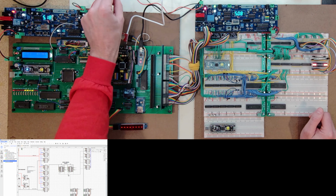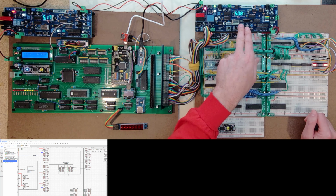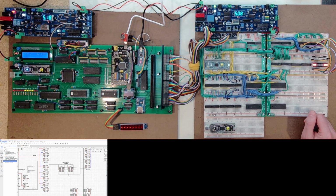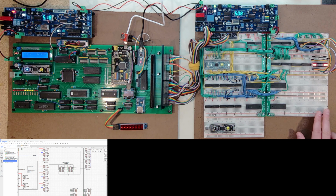I'm then running a small jumper over to this other card, and you can see by the time it gets to the middle of this card, I'm at 5.08 or 9, somewhere pretty close in there. And if I come down and measure down here, which I figured there or here are the 2 worst points of the board at this point, I'm at 5.07. So I'm barely losing anything as this circuit is under load and running. And so I'm pretty happy with that.